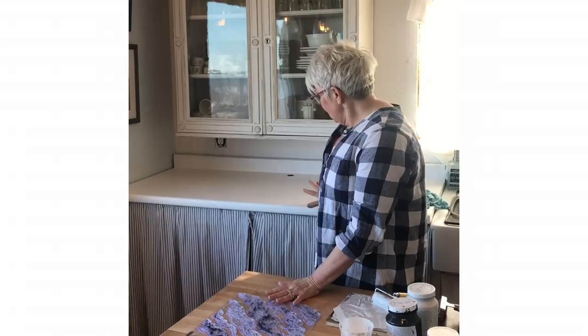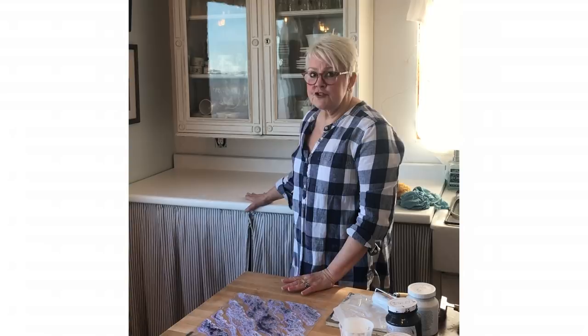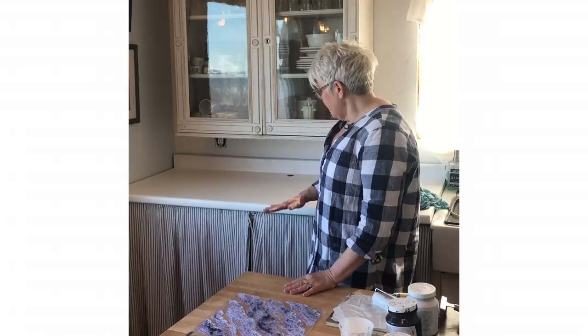I'm going to do this entire surface with my sea sponge — Casement paint mixed with clear glaze. I just want to get this white sponged on to give it an underlying texture, just a little bit. We have sponged the entire surface with Casement paint and the clear glaze. All that does is lay down a nice transparent thin texture over the existing countertop that I had pre-painted.